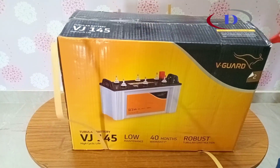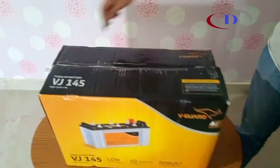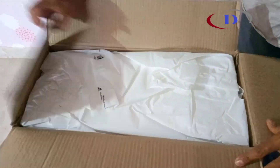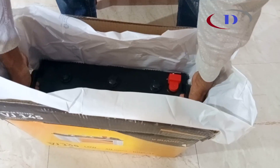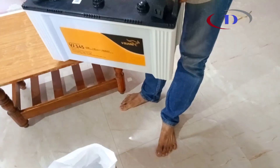Come let's open it. This battery weight is around 42 to 45 kg. With 600W to 800W general running load, it can give you 2 to 3 hours of backup. Tubular batteries typically run up to 750 life cycles, which means it can last up to 5 to 6 years.